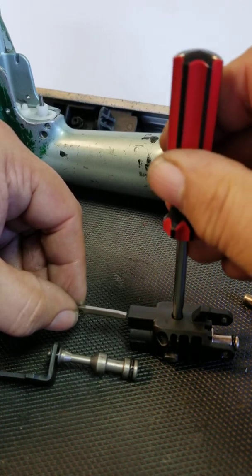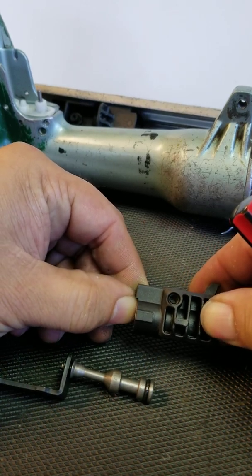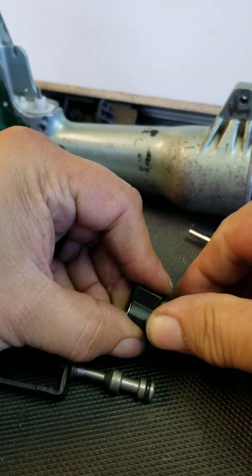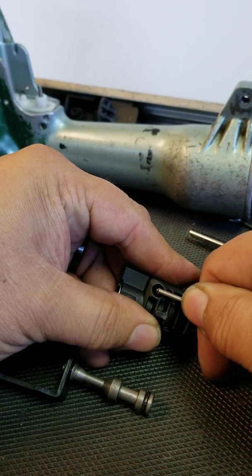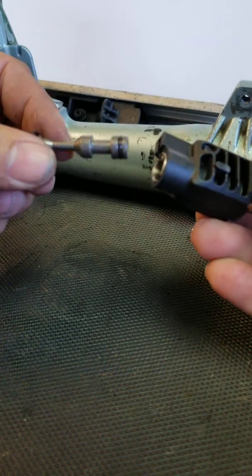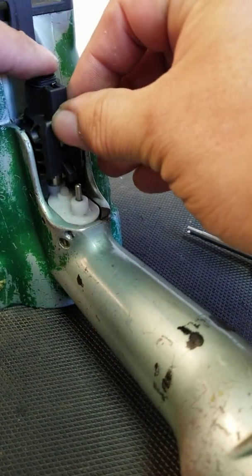So we're going to push this spring evenly down and push this arm in here, then let up a little bit so it will go over it — and there it goes, right up on top of the spring. Then we're going to push it in enough to where we can see through the hole, and we're going to put our pin back in. Push that pin back in, make sure that's in all the way. Now we have to put this other plunger in — push down on the arm so that foot goes up, and put this other plunger in. And there, it's back together again. Then we can put it back on the tool and reassemble the tool.